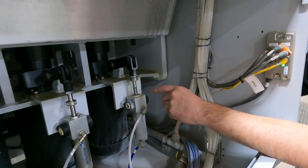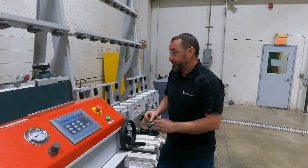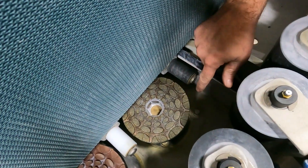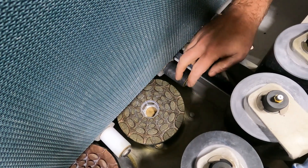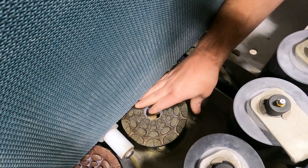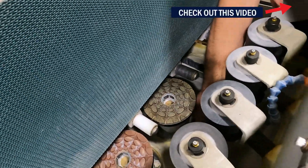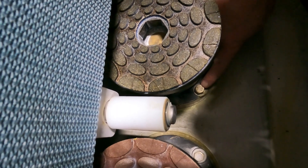Make sure you don't lose them. Once you have that out, then we can go up to the top side of the spindle. It would probably be easiest if you remove your tool off of your spindle with the snail lock off — it will create a little more room for you. We do have a video on how to remove that if you need. Then you will start by removing these four bolts going around the spindle — there are four of them, and you'll need a 9/16 wrench.